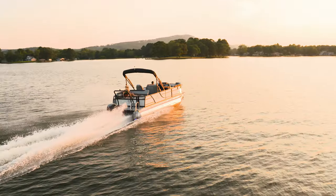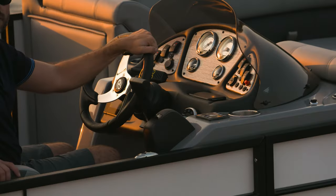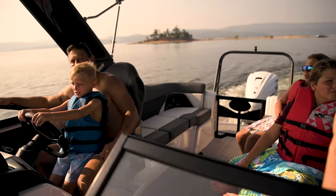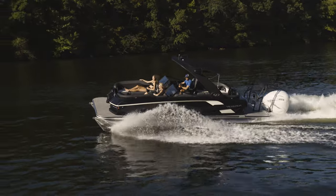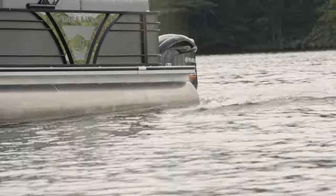Porpoising is an uncomfortable position when the bow bounces up and down because you've brought the stern down too low. Over time, you'll discover a sweet spot to trim to at each speed where the boat has the smoothest ride, optimal performance, and the best fuel economy. You may need to adjust the weight distribution in your boat — the position of passengers and heavy gear — to improve performance and fuel economy. RPMs increase as you change the angle. Never go too fast in reverse or you'll swamp the stern.